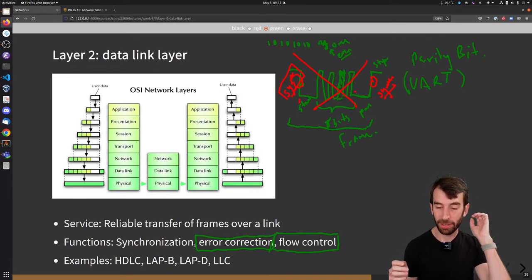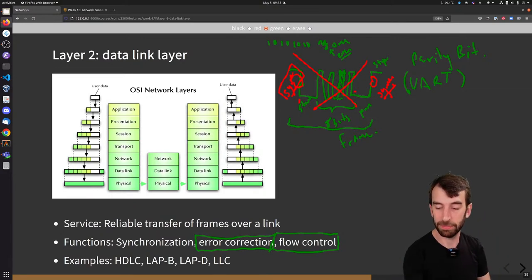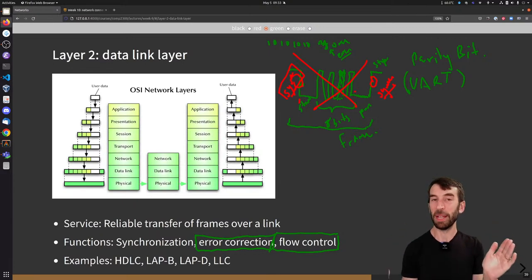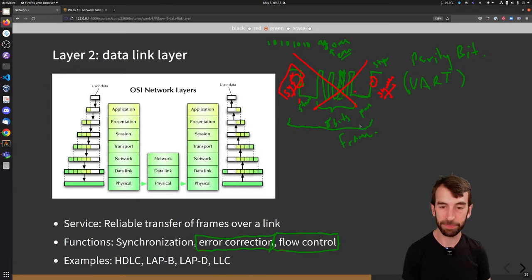So the idea of the start bit and the stop bit is that we only synchronize our watches for 8 bits, and we think we can keep them in sync for that amount of time. That's a very short amount of time, so it's a very good bet. And then every time we do a stop bit and a new start bit, we're starting the stopwatches again, so that we're always together.